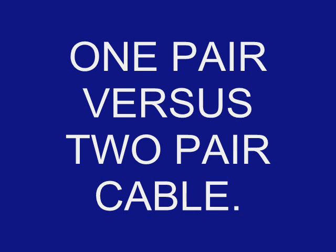One-Pair vs. 2-Pair Cable. Although a second data pair has always been optional in DMX cables, a few powerful production houses require that all their DMX cables have both pairs wired. This is because it can be difficult from the outside of a cable to determine if a cable is single or two-pair. If a production is expecting to use the second pair for some purpose, and there is a one-pair cable mixed up in the rig, it can be painfully difficult to find and correct the problem. Having only two-pair cable in inventory eliminates this chance.